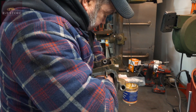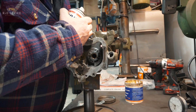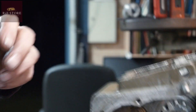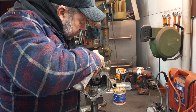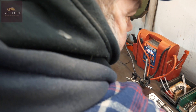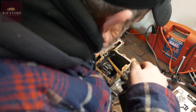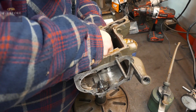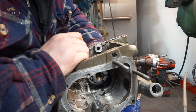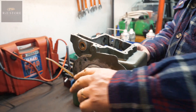So then you've got to keep wiggling it, pushing it, wiggling it, pushing it, and it'll come past the oil seal. There is a tool for doing it, but if you just keep turning it like that, you're okay. What I normally do is give it a quick squirt, push it back out a bit, just to take some of the grease out — because remember this should only run in oil. Grease will compact it and make it tighter. So just give it a little squirt of freeing agent — that's freed that up — and then a bit of oil. Push it past your oil seal. Remember how loose that was? It's got a slight bit, but hardly anything, so you know that's good.